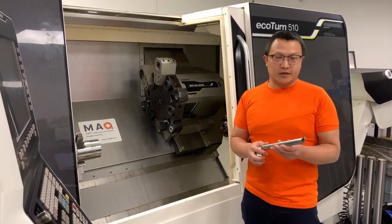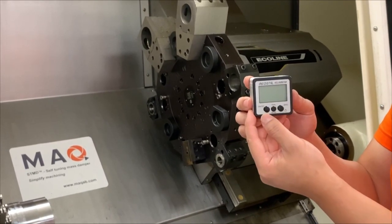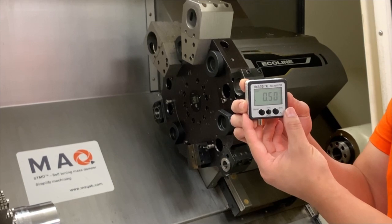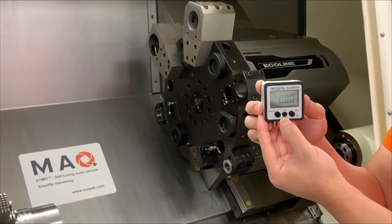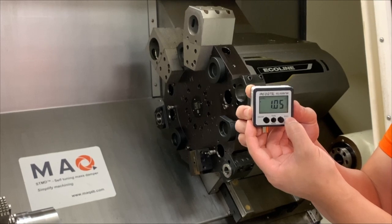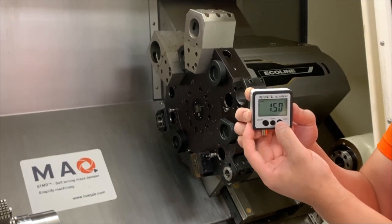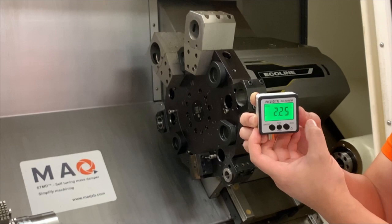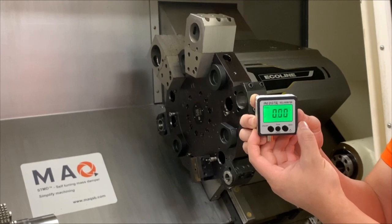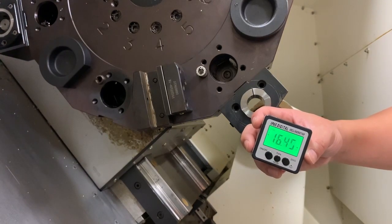Let's see how easy it is to align the cutting tool into the turning machine. The protractor has three buttons on its surface. The first one turns it on and off. The second button is used to hold the tilt, which is not often used in our product. The third button can either set the zero of the protractor, or if you press and hold for one to two seconds, it turns on the backlight, which makes it much easier to see the numbers in a dark environment. Now we are inside a turning machine and the digital protractor is already turned on.